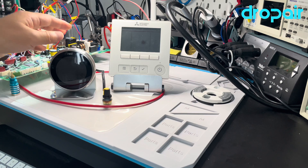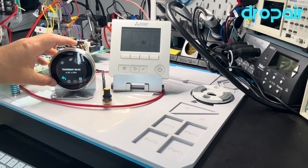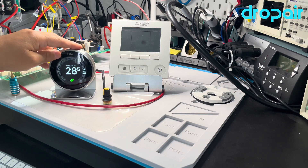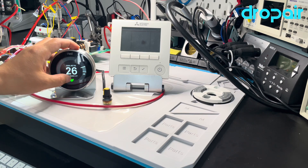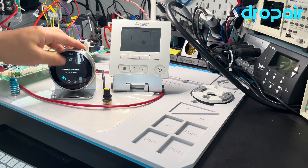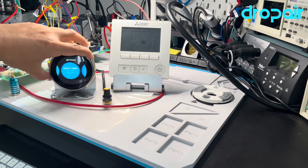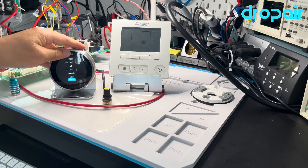So for our new solution, we can start up the cool function with just a one-minute delay. When the Nest ends up the cooling mode, we set the fan schedule to run all the time when the air conditioner is running.